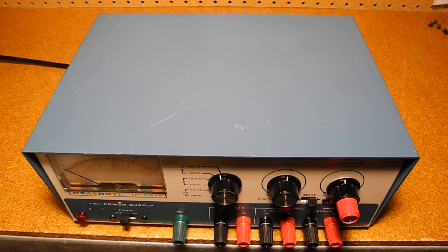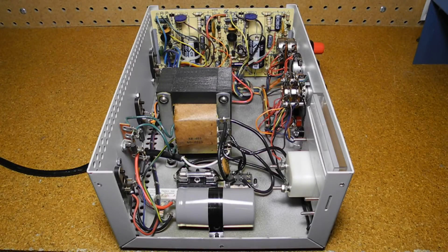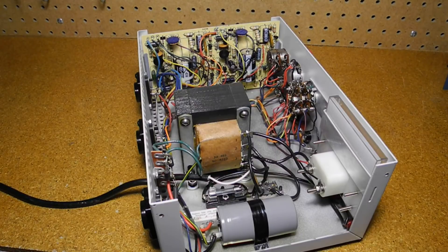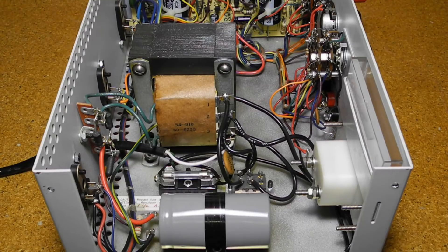Removing the cover, we can take a look inside. The unit is all solid state, utilizing 24 diodes and 18 transistors. The 5 volt supply uses a regulator IC, while the 20 volt supplies use circuits with discrete transistors. Three output transistors are mounted on the back of the case for a heat sink and are insulated from it. Most of the wiring is on a single printed circuit board. Two small transistors on the PCB also have heat sinks, and there are two trimmer pots on the PCB adjusted during calibration. No high voltages are present on the printed circuit board. It also uses point-to-point wiring with a factory-assembled wiring harness for connections to the front panel, meter, large filter capacitor, and transformer.